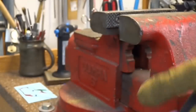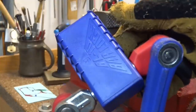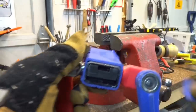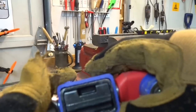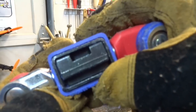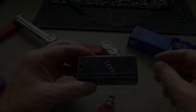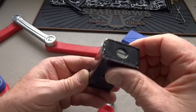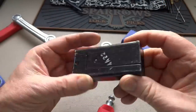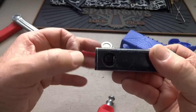It does appear to be case-hardened, however the case hardening is fairly deep. With 10 or 12 strokes of a hacksaw I started cutting into it, but that outer shell — the case hardening itself — is what's going to dull the hacksaw blade. So while we could do it this way, you'd need to carry a heavy grinder and power source; it's not going to be a surreptitious entry. Those bars are pretty tough. Now let's take a look at the lock itself. I cut the end cap off — just a thin shell of plastic — and exposed the bottom. It is a solid steel insert, looks like it's welded in as part of the outer shell casing. Beneath the plastic housing is solid steel, folded and hardened, spot welded in different places so you can't punch from the front. The shackle will prevent it too — you're not going to be shoving that out.